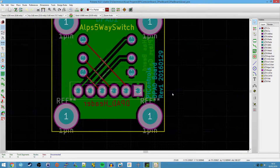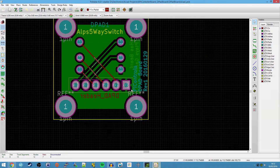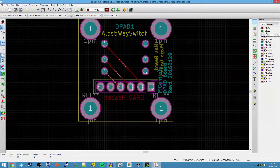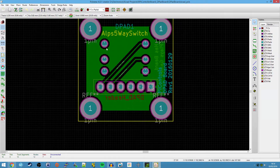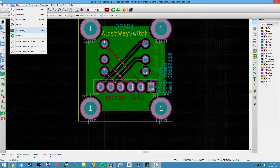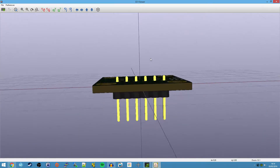So let's zoom in a little bit. Here's our ground pin. Pin number four here is the ground, connected to - let me just turn off the rear copper layer. So what you're seeing here is the back layer of copper. Pin four is connected to this ground plane here. And you can see that pins six and five are connected down to this row over here. Turning on the front copper, obviously we've got pins one, two, three hooked up here as well. So this one is going to be on the left-hand side.